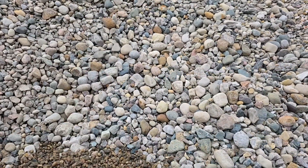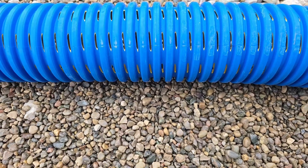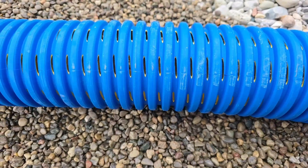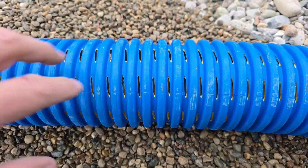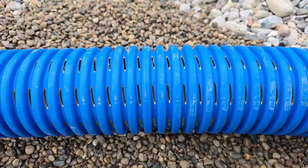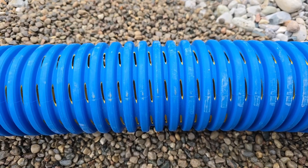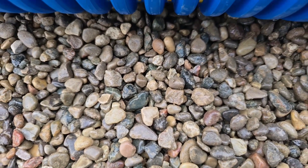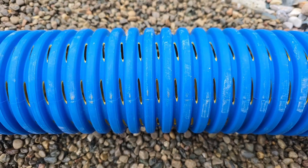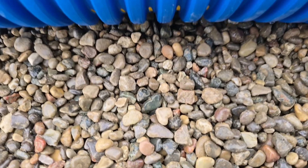Get yourself a good stone filter zone. I'd like to see four inches of pea stone under the pipe if you're not going to use fabric. Now the rest of the drain has to be in pea stone. I would recommend not using perforations that are opened up as much as our eight-slot pipe — you're going to want to go with something that has a finer, saw-cut perforation, because you're downsizing to a very small fine stone. You don't want the aggregate to get stuck and plug all the inlets, so you have to use the right pipe. Knife-cut pipe would work fantastic for this.